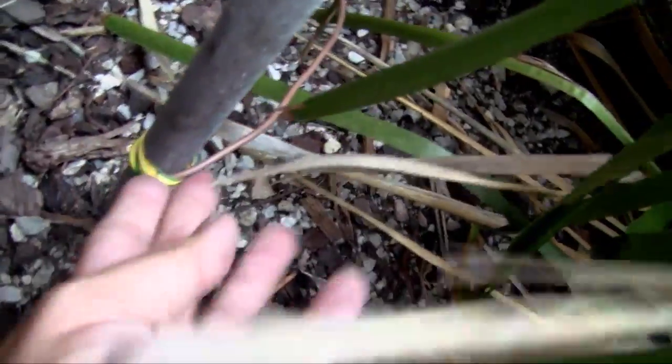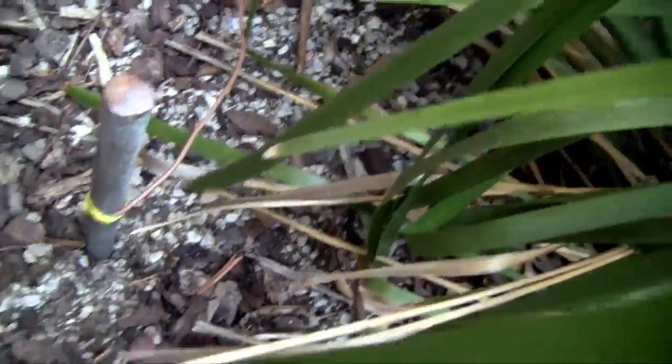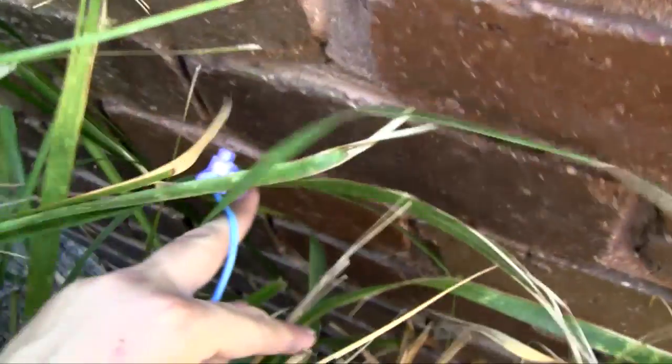I put this rod in the ground. It's pretty far down. We whacked it right in, me and Dad. I wrapped a whole lot of exposed copper wire around it and taped it in place, so that's not going anywhere. Now that brown wire goes along these bushes, and it joins to another wire. There's a joiner, just because I needed length. I'll show you guys, there you go.